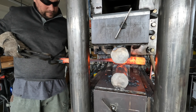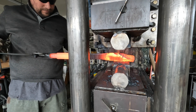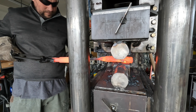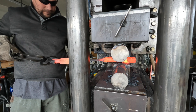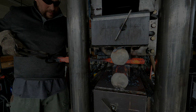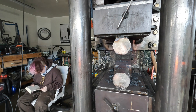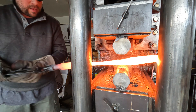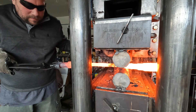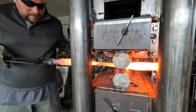I wanted it to actually be longer because technically this is a sword, but I fell under the minimal length I wanted just because of inclusions on the end where those threads were. I probably should have ground those threads down before forging - I probably wouldn't have lost the material on that end. Here on my second heat I'm already getting quite a bit of length on my drawing dies.